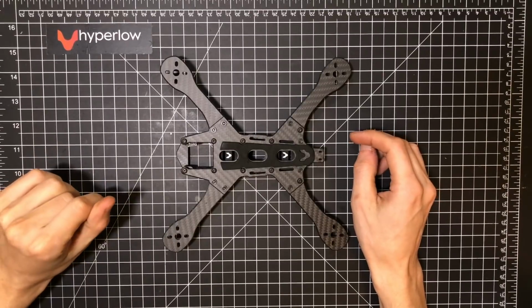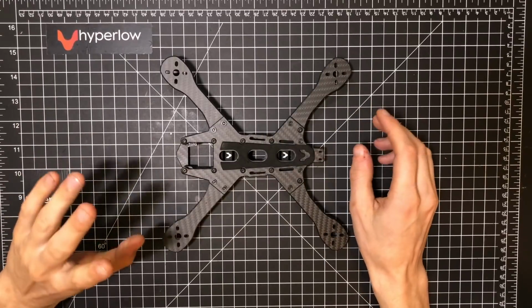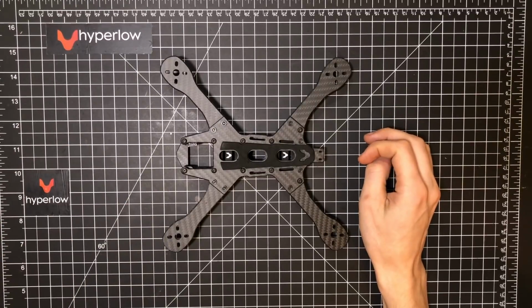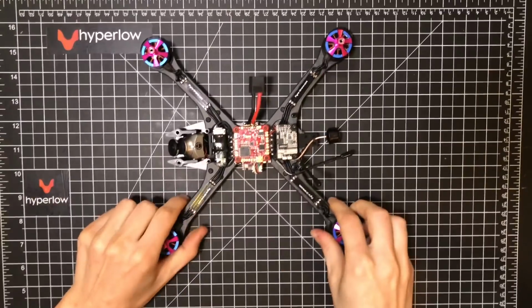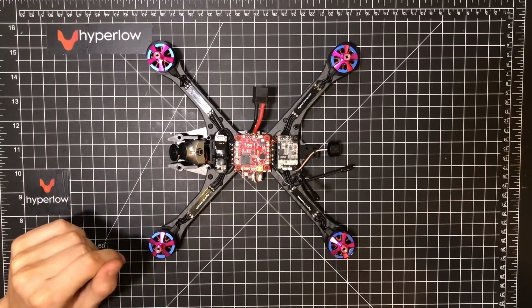You can go from 20mm plus build height down to 10 to 15 to a true mid-mount, which lets the battery sit securely in the prop plane. And I'll explain the differences in flight performances of those later on. But now I will just show you an example of how the electronics can be laid out. So this is the 6-inch version, which is also immediately available.